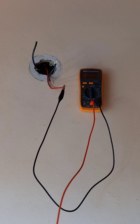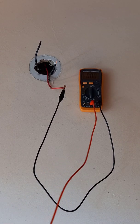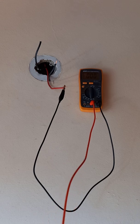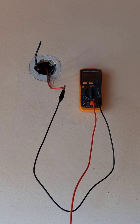Because of this issue, that neutral up top is coming out, and I'm going to rewire the other light fitting — from the other lights on that side, from the middle one to this end veranda light. I'm going to climb in the roof next and show you up there where this neutral goes compared to where the other one comes from from the board.